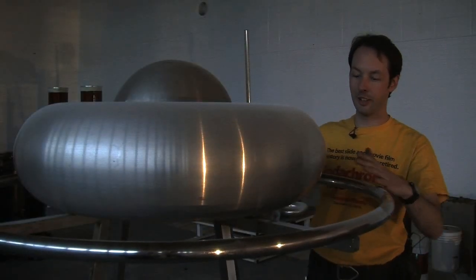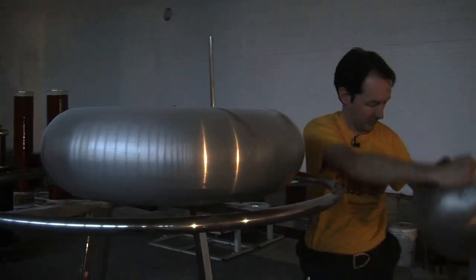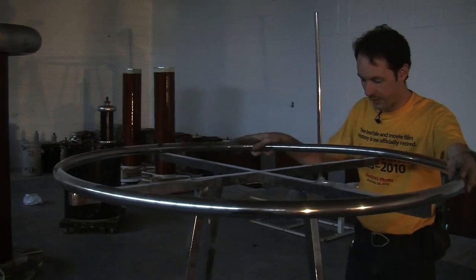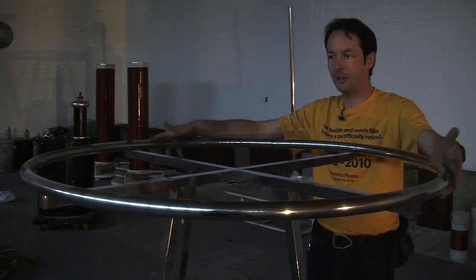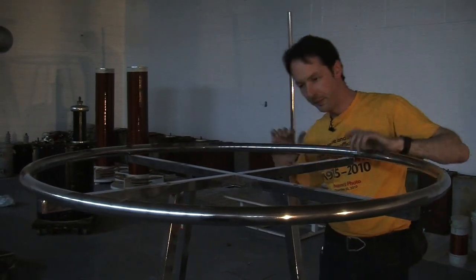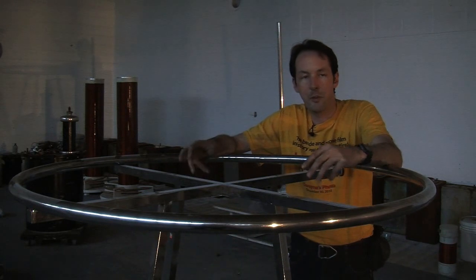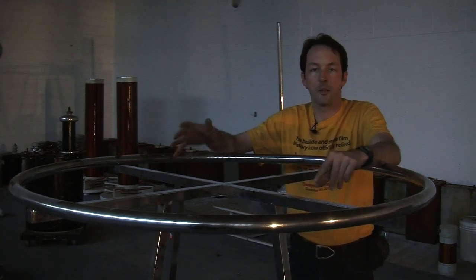This here is our grounding target — it's actually a bunch of different things I've got from surplus stores. There is this clothing rack; I got it from B&B Surplus in town for about $10. It's really easy to break down for transport, it's all metal so there's nothing to burn. I like it — it's round. Everything in a high voltage lab is very round and curvy as a rule, because the higher the radius of curvature, the higher the voltage potential has to get before breakout.